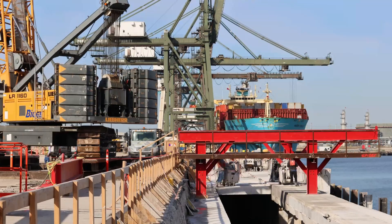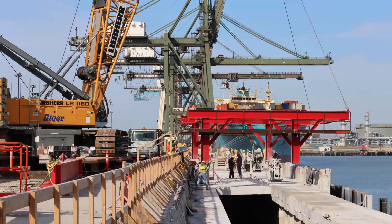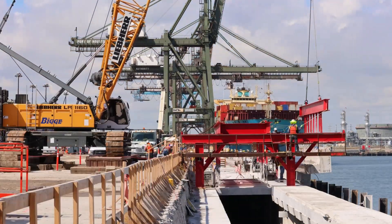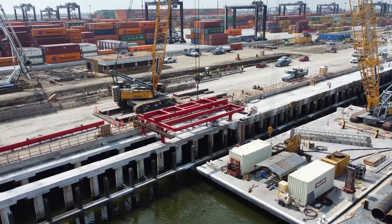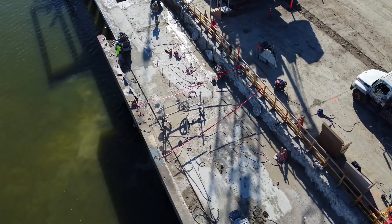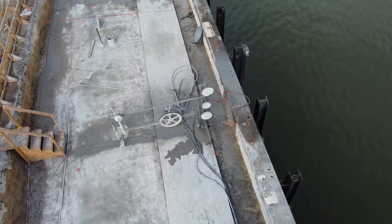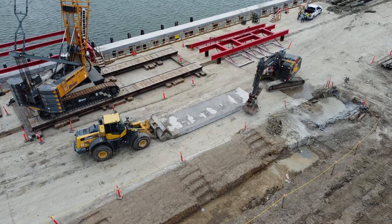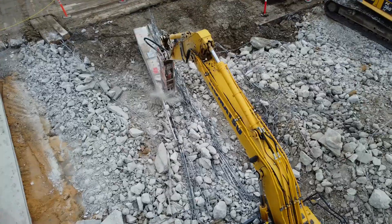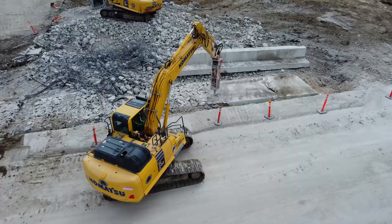The Spider is positioned on the line of existing piles that will remain. The future piece is secured with shackles to the frame that sits on top of the Spider. The slab of the structural deck is cut with a typical saw-cut blade, full depth. Once the slab piece is free, it is lifted from the Spider. The face of the wharf is removed the same way; however, it cannot be cut with normal saw-cut blades due to its awkward L-shape – instead, it is cut with a chain cutter. Once a cut piece is removed from the Spider, it is placed on the deck behind the crane, then crushed and hauled away. Concrete and steel will be recycled and used for other applications.